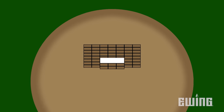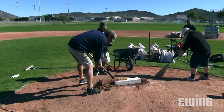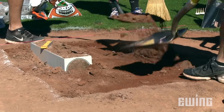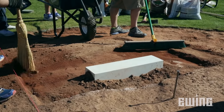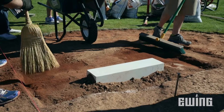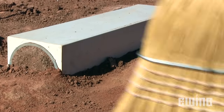At this point, you can lay out the pitcher's table. The table should be 5 feet wide, 3 feet deep, with the front edge 6 inches from the front side of the pitching rubber. Excavate or add loose clay as needed until you reach a level that allows the clay block to sit about a half inch below the rubber. It is extremely important that you remove all loose debris and sweep the entire surface of the mound thoroughly after excavation.